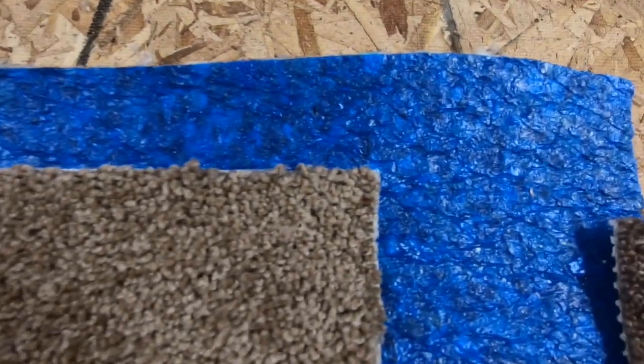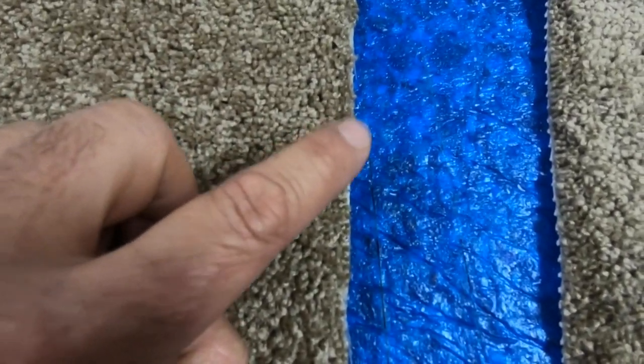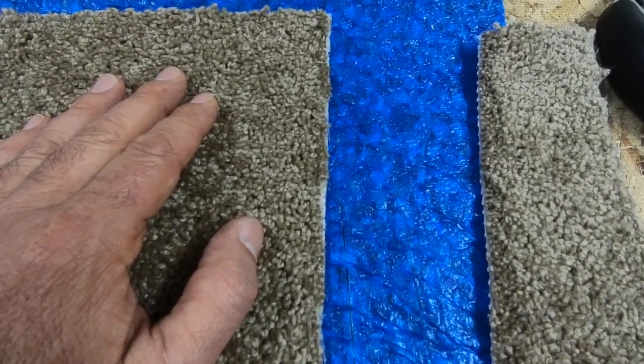The preferred method for preparing carpet seams in a cut pile residential carpet is to use a top row cutter. A quick recap: using a top row cutter gives you a nice, straight, even edge. Using the straight edge from the back method, you end up with areas where you cross the rows and get exposed backing. Joining those pieces where these areas meet will give the appearance of holes in the carpet. So again, the preferred method is to use a top row cutter. Thanks for watching.